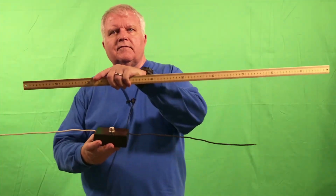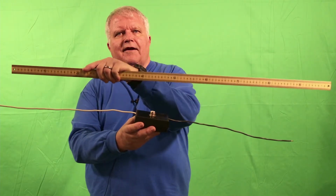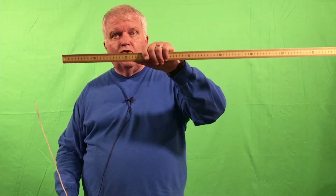because here's a meter stick. Whoops, I'm right in the same frame there, kind of. I'm not coordinated. And the camera is actually reversed orientation. So roughly the same. So when we're talking about the 2 meter band, for example, we're talking about 2 of these for the full wavelength. Do it like that. Whereas a half wavelength for a half wavelength dipole is here, all right? Now, this can be a horizontally polarized antenna, remember the electric field, or it can be a vertically oriented antenna. Get the white going up, that's better. This is a vertically oriented antenna.